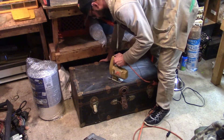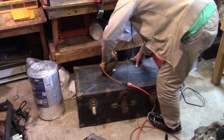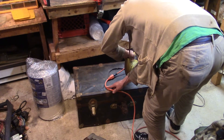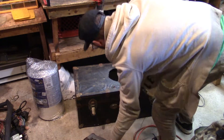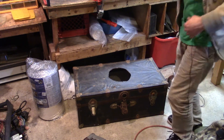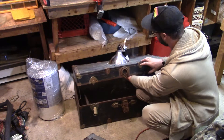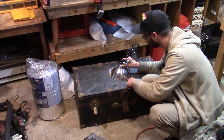So I took this box — I was going to originally build a much larger box for this project but I decided to start small, a smaller scale. This is an old chest that I found that was destined for the dump, picked it up for free. I proceeded to find the center of it — it was about three feet across, so it would fit most of the smaller designs that I had — and found the center of it, lightly traced a circle after pre-drilling it, and carved it out so I could fit this light fixture in.